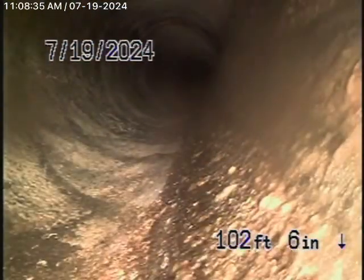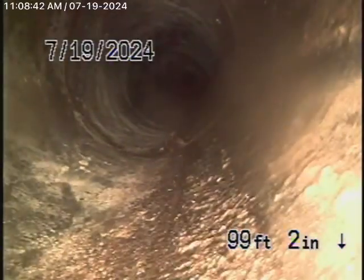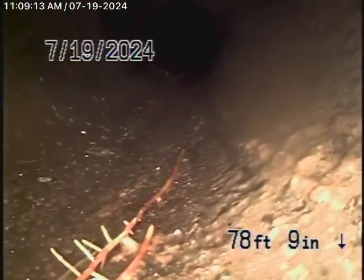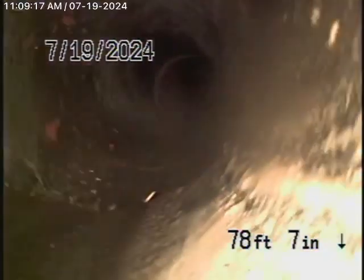As we come back, it's a big six-inch clay pipe coming back from the middle of the street towards the property line. You're going to see little bits of roots and minor surface cracks — I look for big problems like big holes, collapses, or major roots. The pipe is getting a little old and is obviously the original pipe, but in my opinion this looks like it's in pretty fair condition. You can see little bits of roots coming through the joint and very minor surface cracks, which is very common on clay pipe.